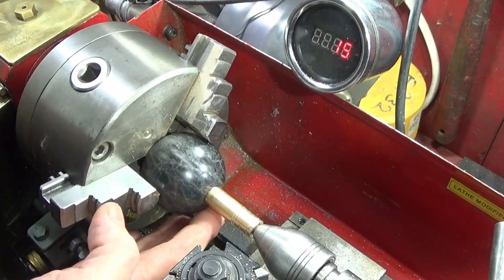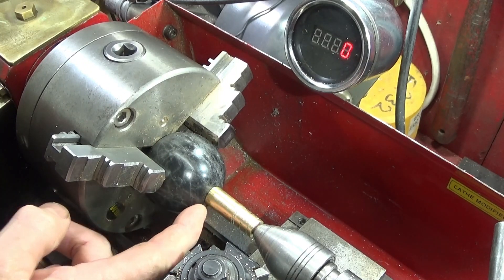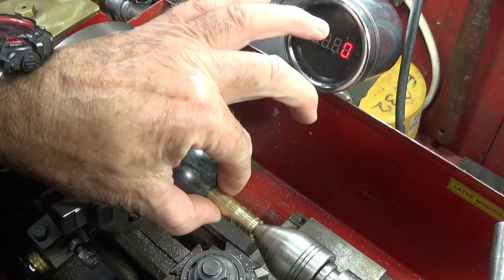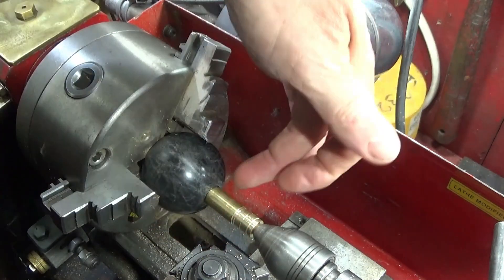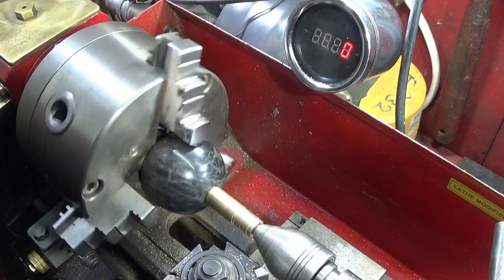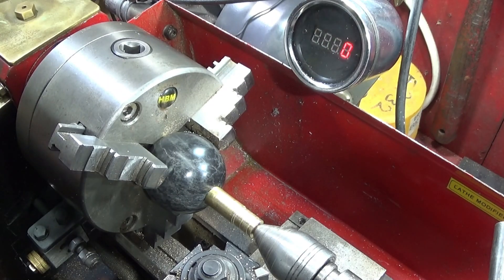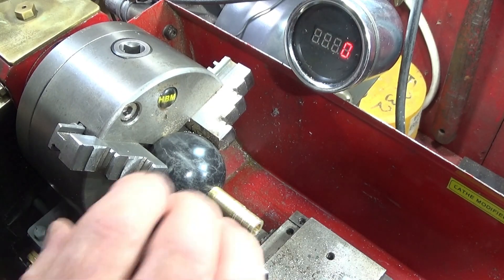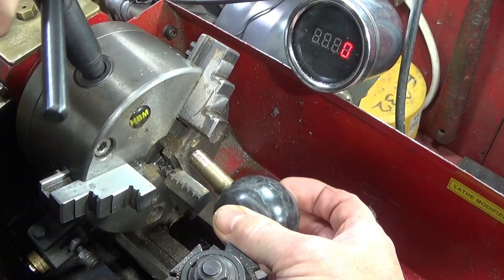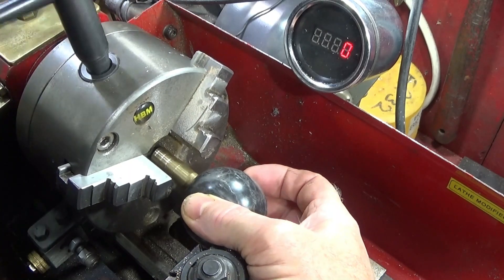You can see there that the drill ran out when I drilled it, and I managed to clean it up with a small carbide boring bar to make it run true again. Then I put this spigot into the marble with some Loctite 638, so now it'll run fairly true and I can also turn the assembly around and drill the other end for the other piece.